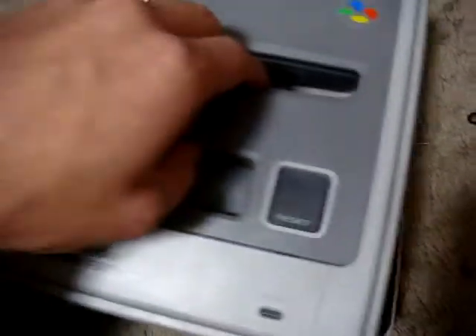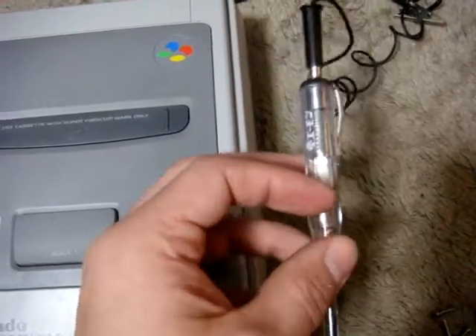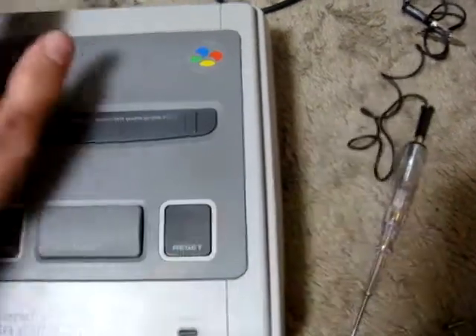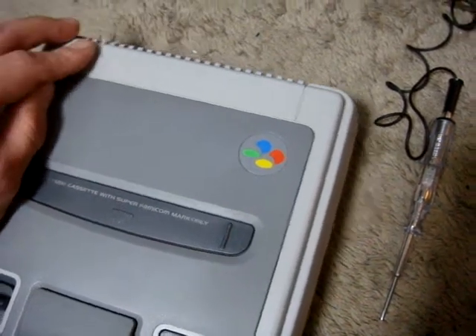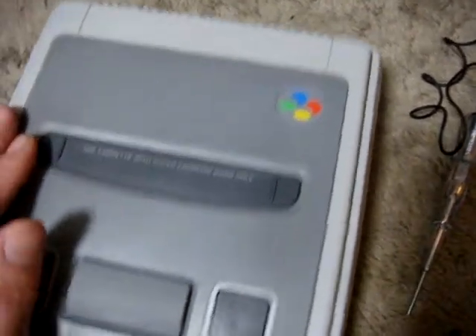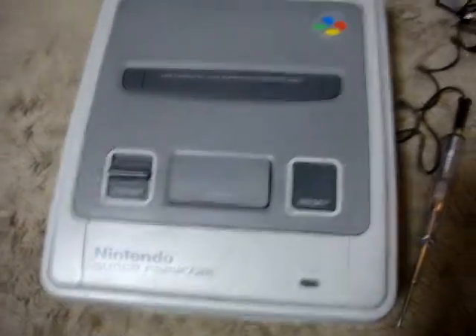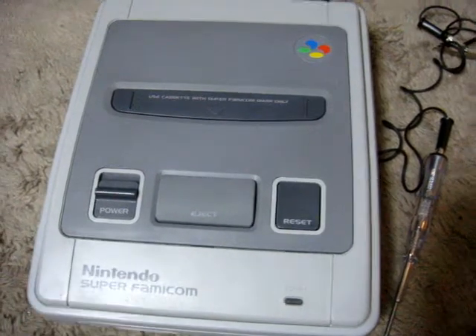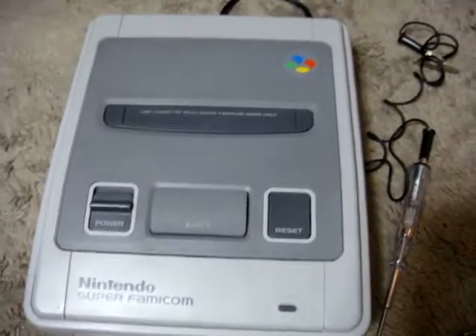Like I said, with anything start the simple route — make sure you've got power coming from your AC adapter, and once you've cleared that up and you know it's not the AC adapter, check the back. If you're getting good connections in the back then the third option is to go and replace that fuse, and once you do that you'll be back on the road to playing games again. Hopefully this video will help you out a little bit — I'll put up another video here soon, so thanks for watching.